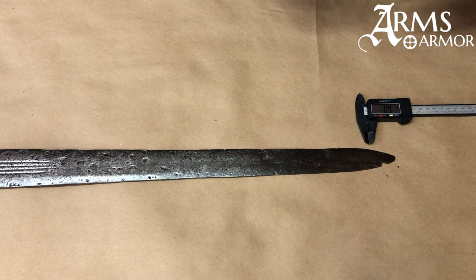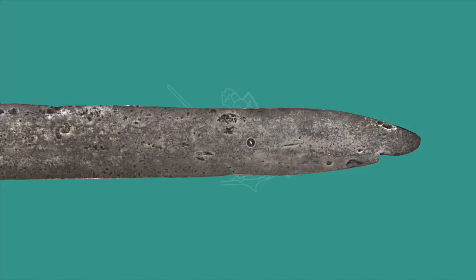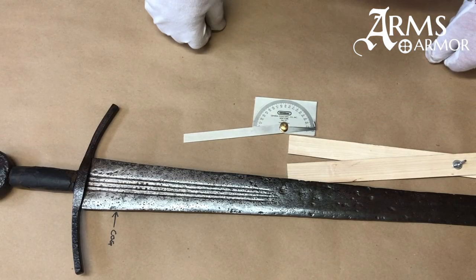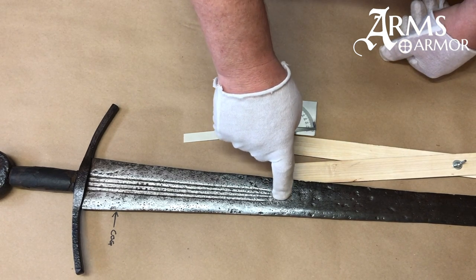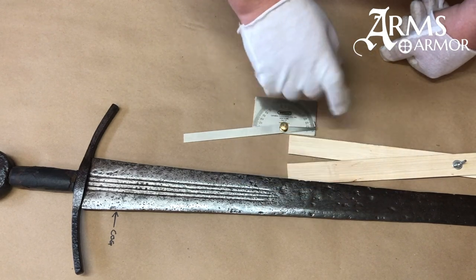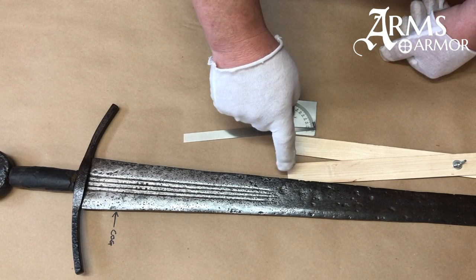Just back from the tip we're under one millimeter — 0.9. This tip gets very, very thin but is still a very effective weapon. Most of the original surface is right there, not due to significant corrosion or grinding; this was the actual structure of the blade. Another interesting aspect is the bevel — from where it is almost flat, or in some cases appears slightly fuller in the center, but hexagonal in cross-section, with this bevel of the hexagon out toward the edge.